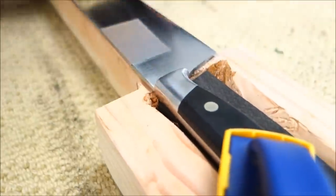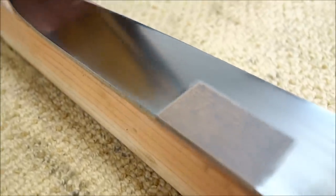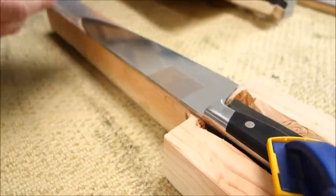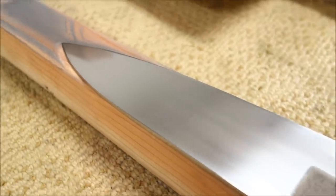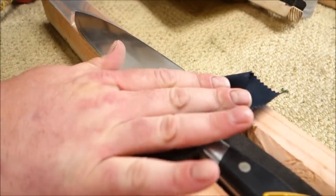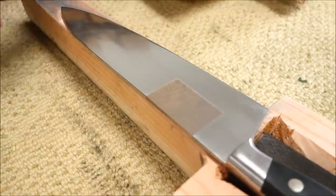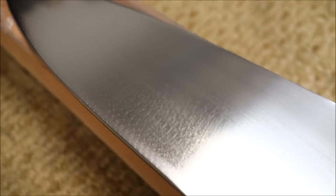You can already see it looks better, but it does take a little bit of time to get those really nice finishes. Then you take a little cleaning cloth and some polishing powder — we sell a Shun kit which is very useful. It's a polishing powder that helps remove oils from non-stain-resistant knives and cleans up the surface of the knife quite well. In just a few minutes you can see the improvement — and we can keep going to achieve a whole mirror finish on the knife.